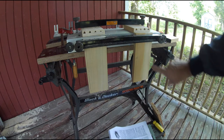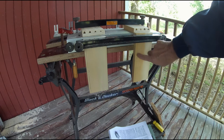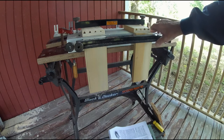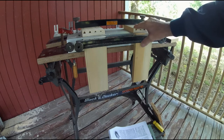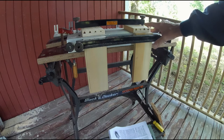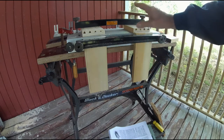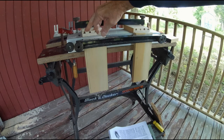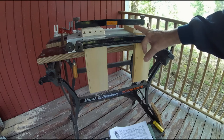Just to show you what kind of happens when you do that — you can see that the inside, or I should say the bottom, is away from the pin. They don't want you to do it that way; they always say the bottom of the box should always face the pin. But because we're going with the 7-8 rule, we're allowed to do this. It doesn't matter which way the bottom of the box is — either against the pin like this one, or away from the pin like this one.